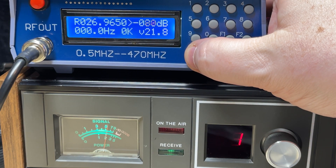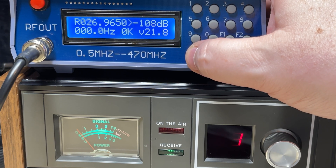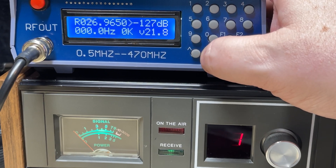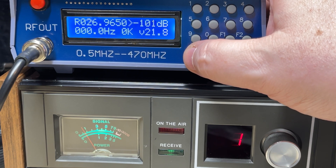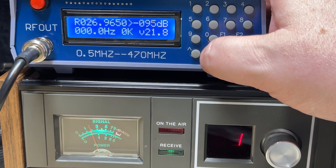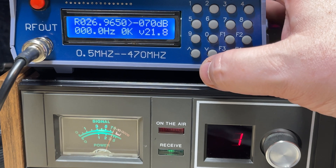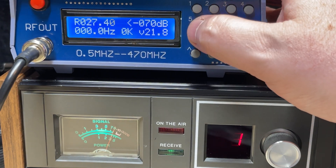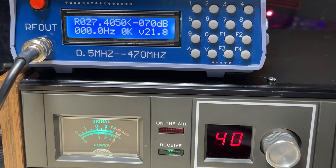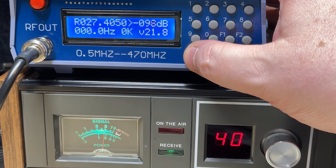Let's have a look at it with the radio, and as you can see there's a marked improvement from when we started. You can still hear a pop around 101/102 — that must be when the processor tells the other chip to kick in and attenuate the signal further. So what we can gather from this is: the first chip does the initial 31 dB attenuation, and as soon as we hit 101/102 the second chip takes over. The first chip is fully attenuated, and then the second chip attenuates it further.